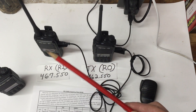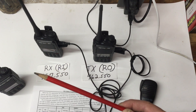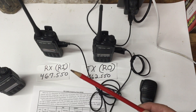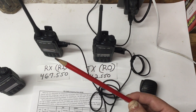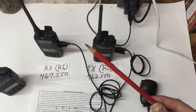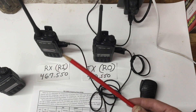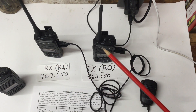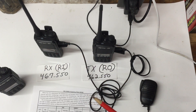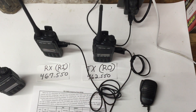For the simplex repeater, you just need one radio and either a laptop with free software or a box you can buy. The nice thing about the box is you don't need a computer — just plug it into your radio and put it anywhere. We'll do another video on the simplex repeater. This setup here is a full duplex repeater. Hopefully this helps you get going — it's great for hunting or any situation where you need a quick throw-up repeater. Post any questions in the comments below, please subscribe, thank you and have a good day.